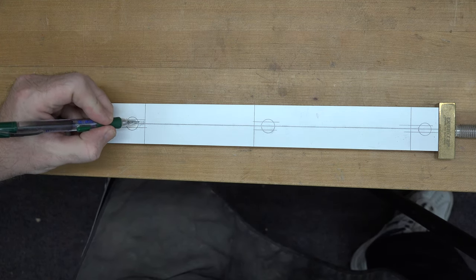I have a brand-new number seven reverse-tooth blade in the scroll saw. On the female end I've taken the pieces to the table saw and cut the square edge — one less thing to cut on the scroll saw. All we're going to do now is cut out the female keyhole and the male key on the opposite side. The last thing to do is give each piece a good sanding, paying a little extra attention inside the saw kerfs for the track, since there's still a sharp edge there.